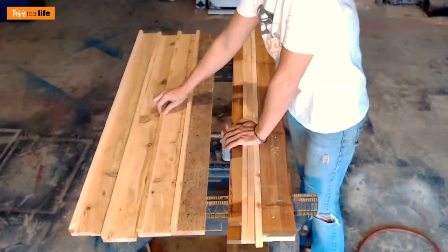So, our shelves are done. Our plate stops are tacked onto our shelves. What's next, Better Homes and Gardens? Let's see. Measure and mark placement of shelves on side rails to help determine shelf placement. So they went from top down 12, then 12, then 12, and then there's a tiny little baby shelf that's 6 inches. I dig that plan. I'm gonna make it just like this.